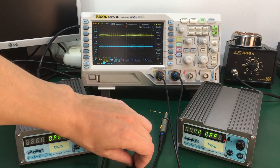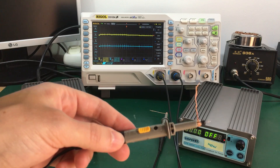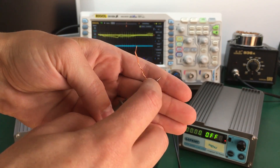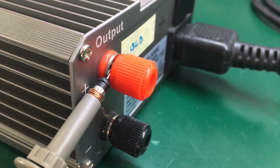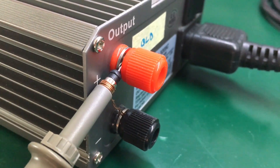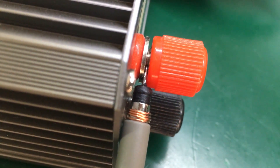I will be using exactly the same setup. I have the ground leads removed from the oscilloscope probes and I have improvised some short low-impedance ground connections right on the ground contact on the oscilloscope probe. The tip of the probe goes to the positive terminal and the ground shield is connected to the negative terminal through that copper wire — it's not touching the metal enclosure.